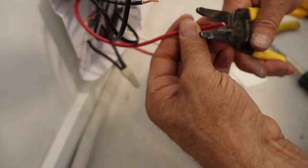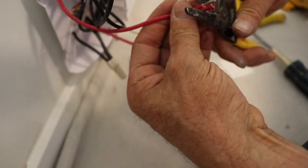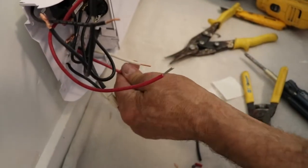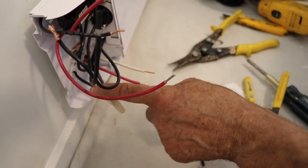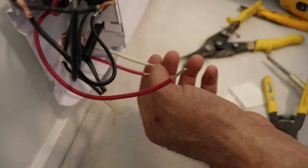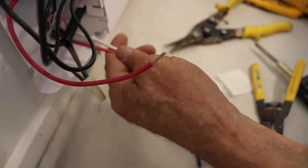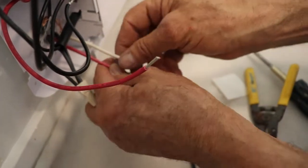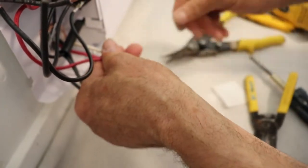This is a 12 gauge wire, and the reason I picked this heater to show you guys is because usually on the wire for the heater you have one black and one red — but this one has one white. It is still a 12 gauge wire, so by code it's good. Just to show you, because you can use the white wire too, and the two work the same.